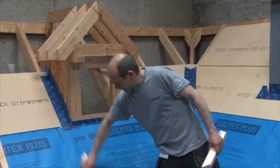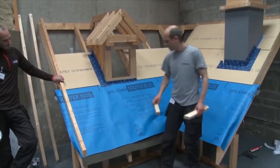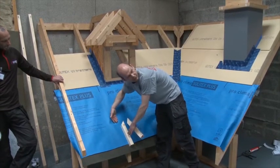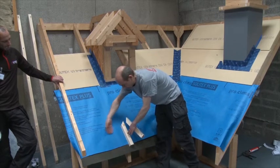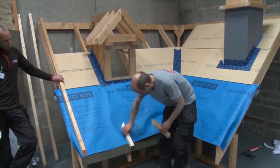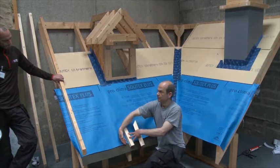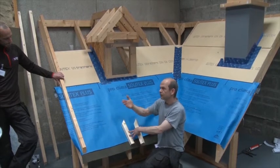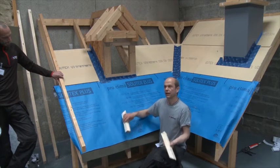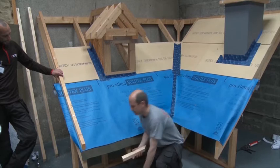With a ventilation button down here that won't happen — it's just small things. You also have your designed ventilation gap on top of your wind-tightness membrane and roofing felt, and water can flow down unobstructed. You can have full rafter insulation all the way to the felt. It really only has advantages.